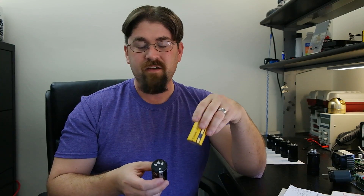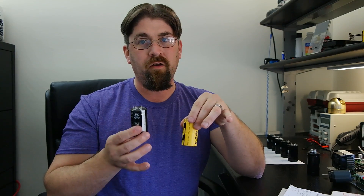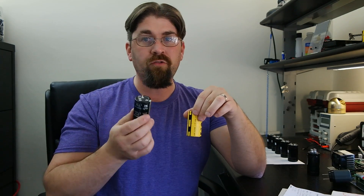For the Eaton — I think it's pronounced Eaton — it's rated 400 farads and I tested it at roughly 410, which may actually just be 400; I don't have $50,000 worth of precision equipment. My guess is the rebadged 4-pin caps are originally 300-farad supercapacitors. At $4.50 each you have to keep in mind they're not 500 farads — more like 300, maybe 260 if you get a bad batch. But the 4-pin ones are actually fairly good overall, and that's why they don't lose much.